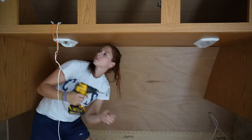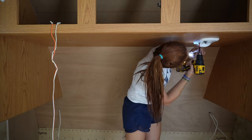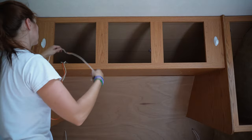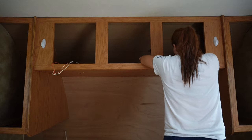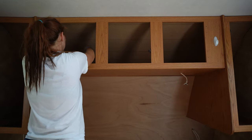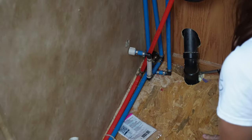I don't need these lights anymore so I'm going to go ahead and take these out. You take the little cap off, it's four screws, and I have already clipped this wiring so they just fall right out. After that I'll get the wiring that's hanging out and feed it through the framing. There is no bottom panel in any of these cabinets right now because the framing and how you screw them in is actually inside the cabinet, so I had to pop the top panel off to get to it. I haven't put those back in yet but it's on my to-do list.